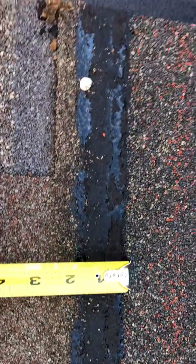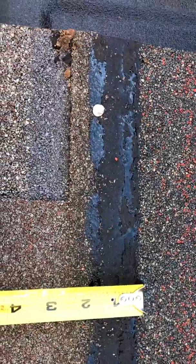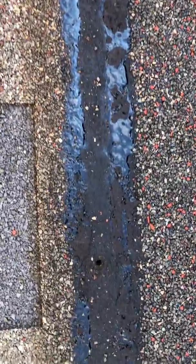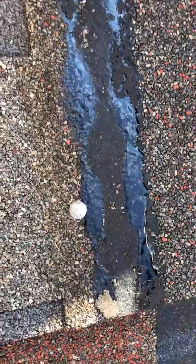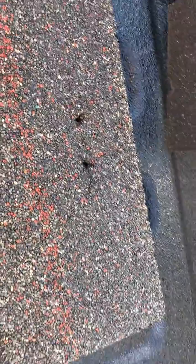I'm going to bring it to your attention that in this particular case you have a single nail. Go the entire length of it, you find a nail hole, which is evidence of a nail before, and then another nail. It's 3 nails in the sweet spot when this shingle requires between 4 and 6. Even above it, where other shingles have overlapped, there's only 4 nail strikes. So again, please pay attention.